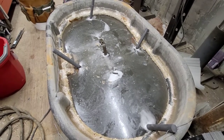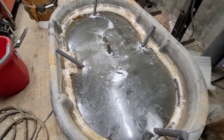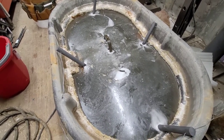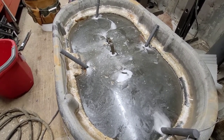What this does is not only convert the rust into an inert black coating that I usually just scrub off anyway, but it also causes paint to delaminate. Some of the paint they have on these old machine tools is really tough stuff. This is actually the second go-around for this particular part.